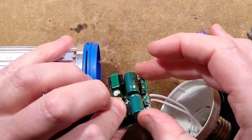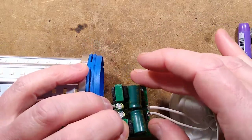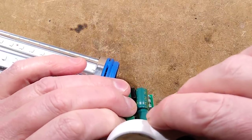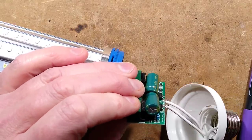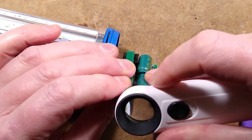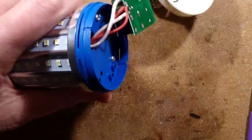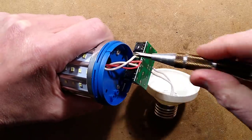The capacitors, incidentally, are right next to those hot chokes and just above the little switch mode chip underneath that drives the lamp. Can't really hinge them up because they've got a very cramped space, but I will try and read the number off that chip. I have no hope of this. No, it's really obscured from sight by that capacitor being in front of it. WS9002S7P by the look of it. Okay, it'll be a generic buck regulator. Let's take this to bits. Let's take it further apart. I'll zoom back out a bit because we're kind of close at the moment.